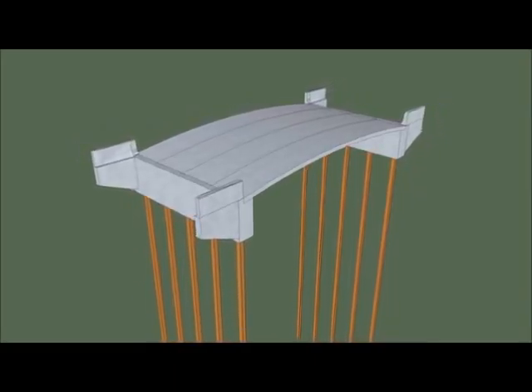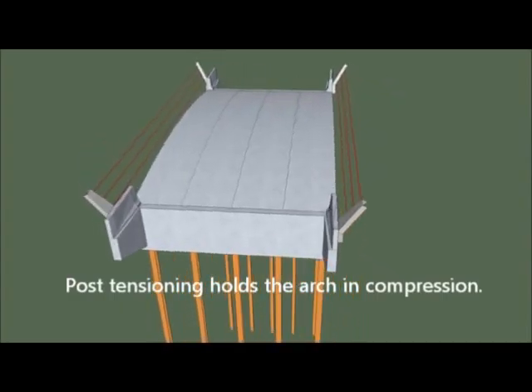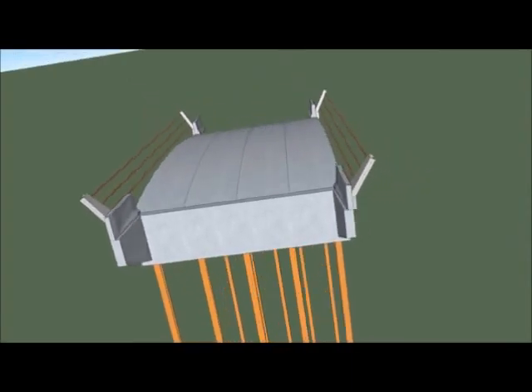You put on the precast wings and post-tension the deck and this would keep the abutments from moving apart when vehicles go over top of it, keep the arches in compression.